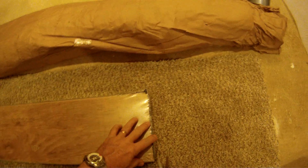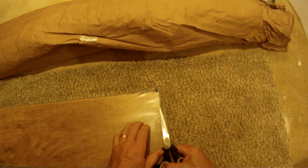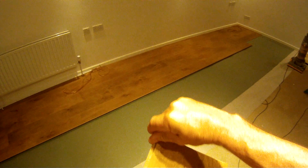Something they don't describe in the box of instructions is how you actually click these things together on your own. Most of the time you're doing this sort of job on your own and trying to lift up the whole line of clicks — it's a very very difficult job. Also be careful to make sure you haven't got any bits in the groove. You can see there's a tiny little bit of hardboard in the groove which will stop the things clicking together, so give it a quick inspection to make sure nothing's been bashed and there's no bits of hardboard in place.